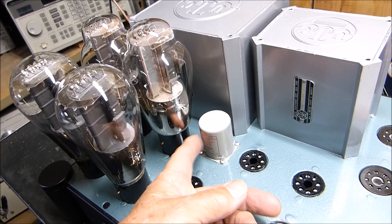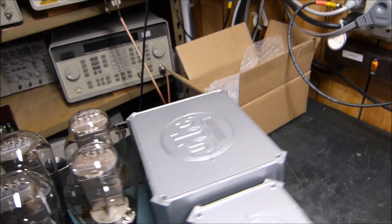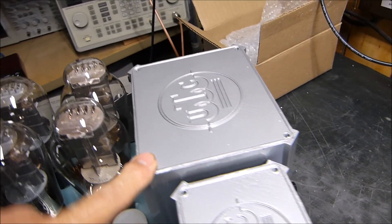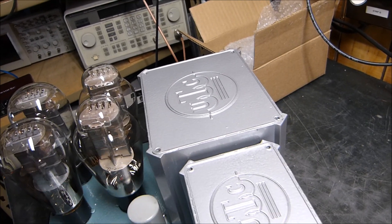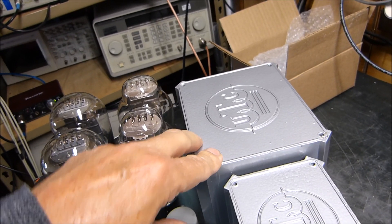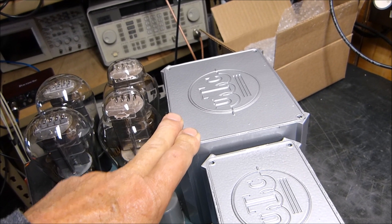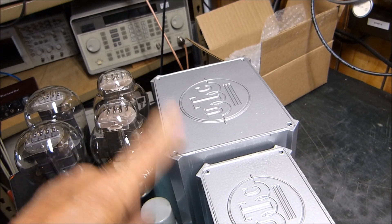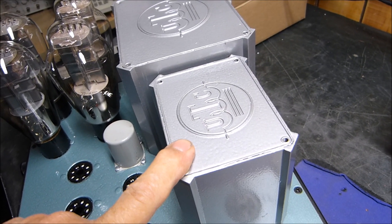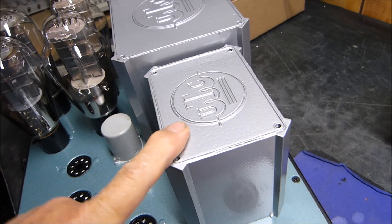That small cathode choke measures 315 Henrys — yes, 315 Henrys, very high. These are beautiful transformers. The output transformer measures about 6 to 8 Henrys, which is surprisingly low. Transformers like the Acrosound come in at 20–22 Henrys. I've got a Chicago standard transformer that measures 40 Henrys, and I expected this one to be at that level. The 50,000 ohm grid winding measures up in the 30 to 40 Henry range.